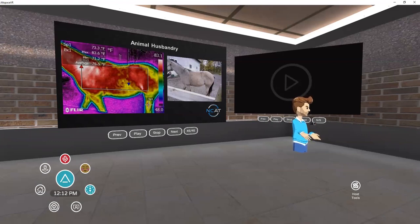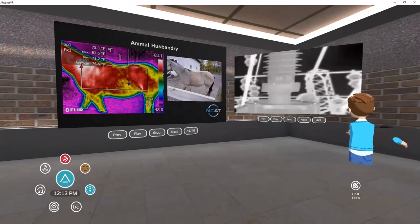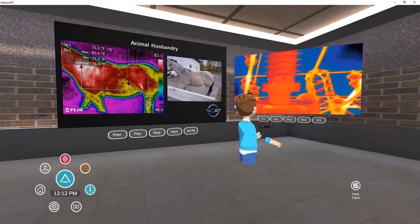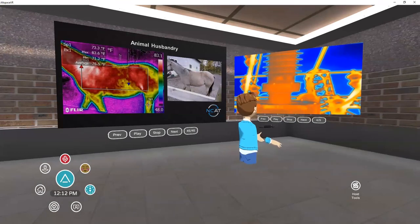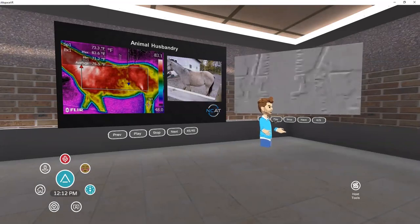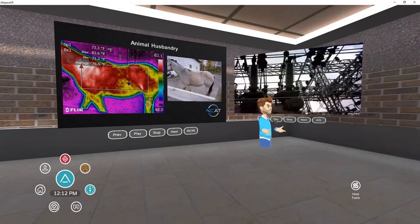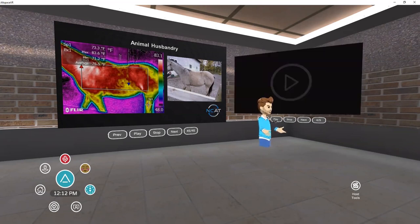For the optical gas detection video, that was approximately a $100,000 camera used to capture a four-pounds-per-day leak. Even then, depending on conditions, it's really hard to image. There are multi-million dollar thermal camera systems used in aircraft. Thermal is definitely one of those fields where you get what you pay for. To see smaller leaks over larger areas, you're going to want a fairly accurate cooled camera, and they're going to be significantly more expensive.